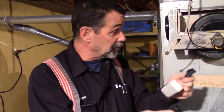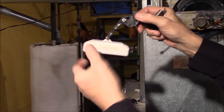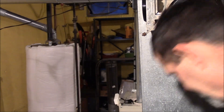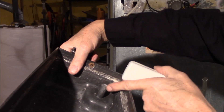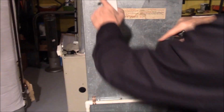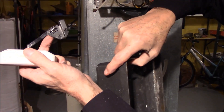The calcium is a problem and everything. So either fix it or get a new float and put it back together. When you get it in, you can adjust the water level — see the set screw here. Set it in the middle to begin with and check to see if your water level is below the overflow in the tray. The water level should be about a half inch below this overflow. Any water that comes up higher drains out and goes down the drain. Adjust the water level using that screw or the little slider up and down to get it to the right level.